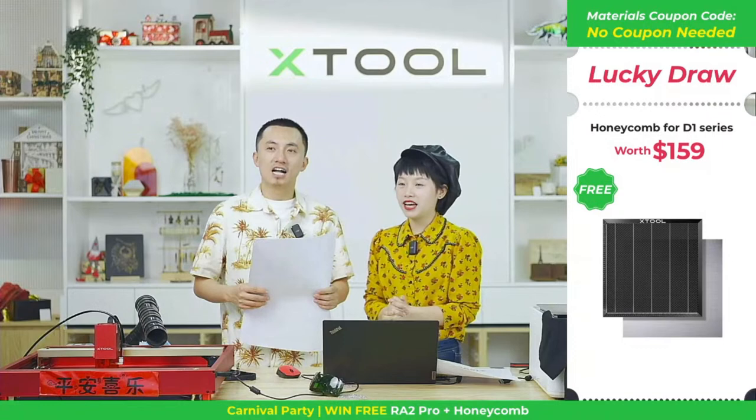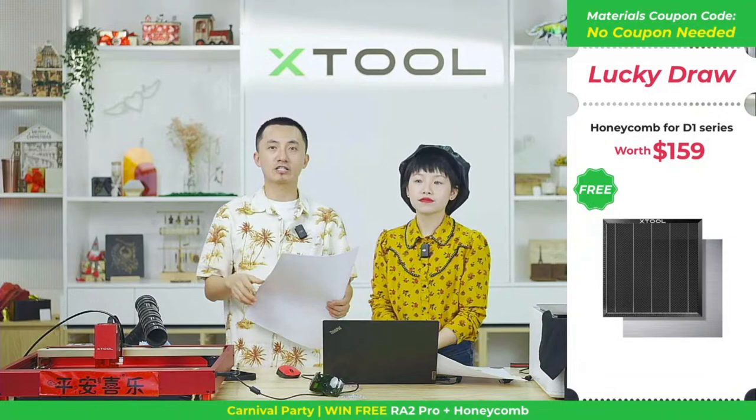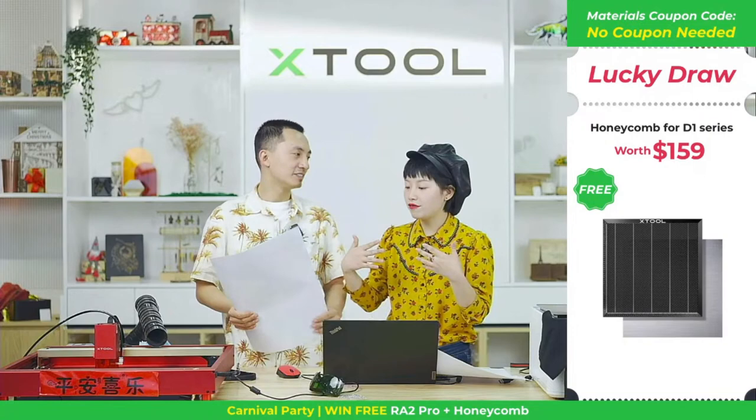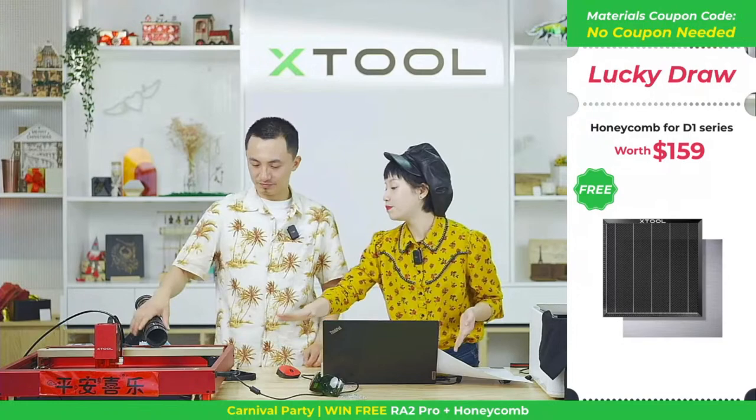Honeycomb is useful because it has honeycomb holes, and all the debris and dust will fall off when you do laser machine projects. So that's good for you to have a cleaner engraving or cutting result. Also, it reduces the heat that builds up during the engraving and cutting process. It gives you a better, cleaner result, and you won't hurt your base plate and the table that you are working your D1 on.